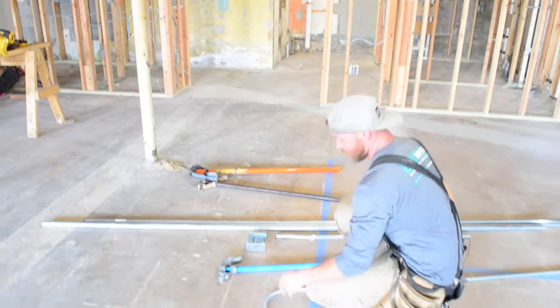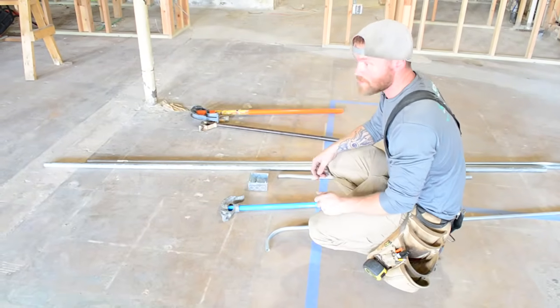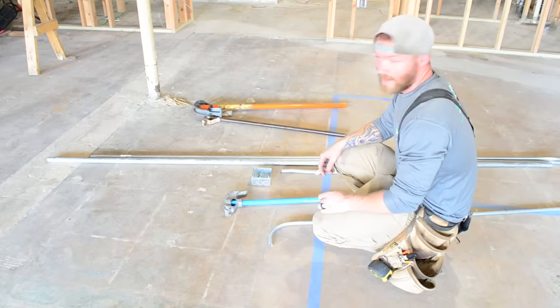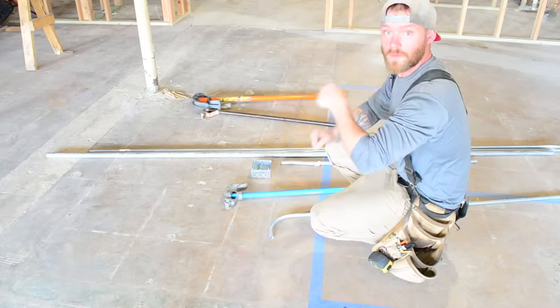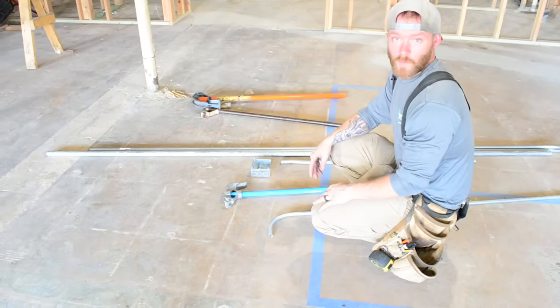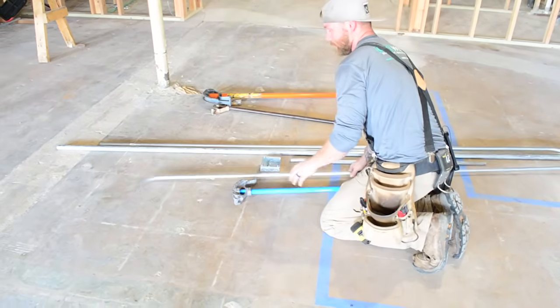Just again, make sure that you keep your foot hammered straight down, and that's for all pipe that you bend, especially when you get into 1 inch, an inch and a quarter. Inch and a quarter, you've got to have a lot of muscle to bend, and so some people just end up trying to pull the handle more than they try to push down on the foot. You want to kick the foot down. That's the most important part. So that's a Stub 90.